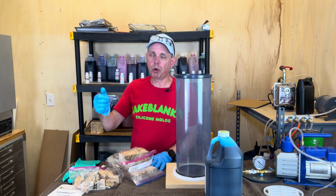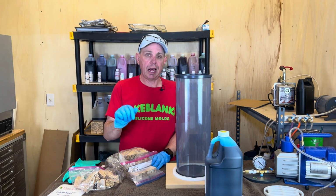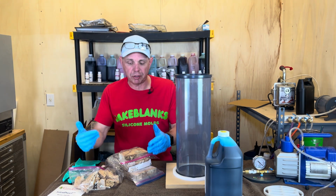You dry the wood. A moisture meter is not going to help you. You put it in the oven. You just keep weighing it until it stops losing weight. I have some videos I'll link down below that go over the whole process, and I'll have one at the end that you can just watch after this video.